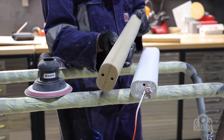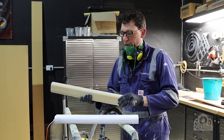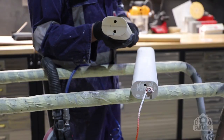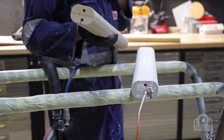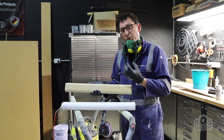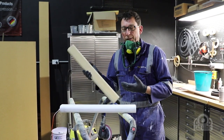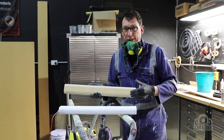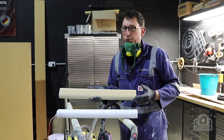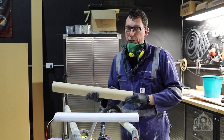So as you can see, we started with our original piece here, two bits of 25mm MDF glued together, and then we profiled that through the router. The reason we're using MDF is it's really easy to work with, although a little bit toxic as we all know, but a very dense material and heavy, so the bookshelves will be quite a heavy stand, and it'll obviously lower the resonant frequency of the material, not have any vibration issues. There's a lot of other materials you can use, but MDF for us is readily available. This is a good quality furniture grade MDF.